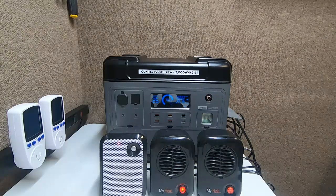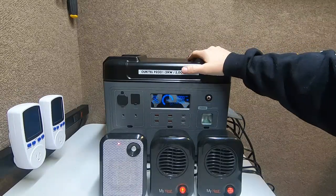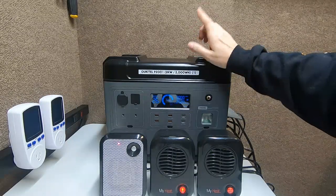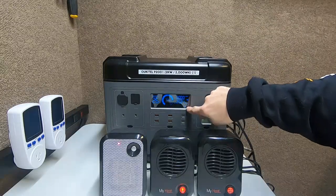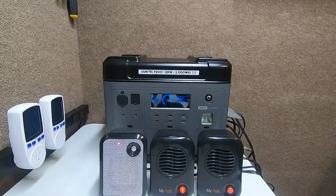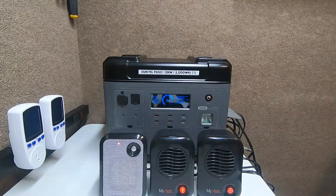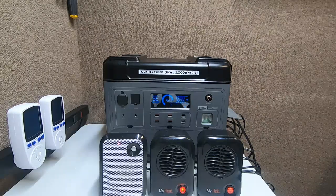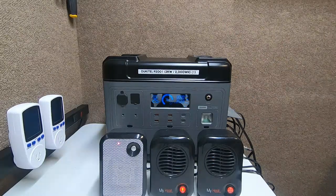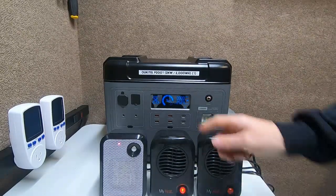The battery capacity is about 1550 out of the 2000 rated on this machine. The inverter is a little power hungry — you lose about one percent of power per hour. However, look at what you can draw out of this machine if needed. At a work job site where you really need a strong tool, this is 2500 watts. What I recommend for power stations is to stay within 50 to 75 percent of rated output — that way you don't create extra heat or burn things up.